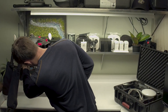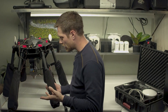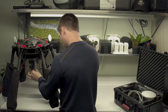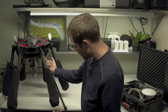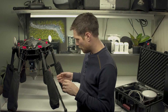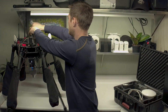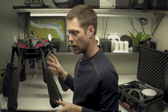You just take the two connectors and plug them into the side. I added a dedicated power supply so it doesn't run off the M600 battery — there are benefits to that, though sometimes you may just want to run it off regular power. Plug in the main power cable, turn on your battery or drone. Normally this plugs into the main power port on the bottom. Press and hold the power button for about two seconds and it'll start calibration. Take your GNSS antennas and attach them — nice and snug, not over-tight. I haven't had any problems with them coming loose.